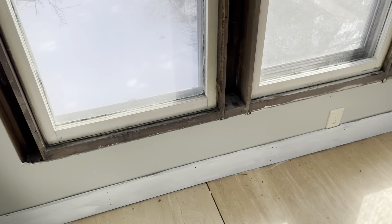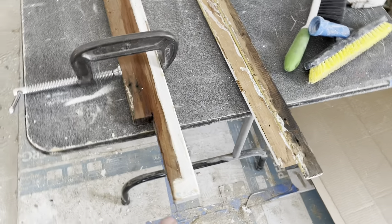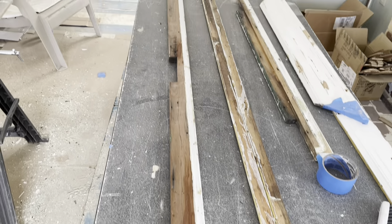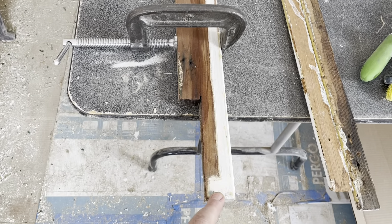You may be wondering what kind of a sill can fit all these windows. As they say in film school: never ask a question that you can't answer. This one cracked a few times in the removal process — I've got some glue and some clamps, but I know it's going to fit perfectly. I've got a problem though: broken glass in a pane. So what I did is have a new piece of glass cut. I'm going to clean out all this old glazier's putty and then put in a new piece of glass and re-putty it.